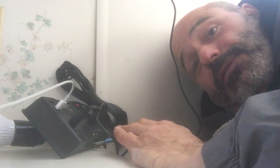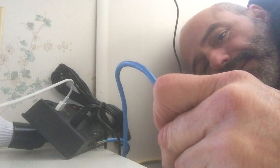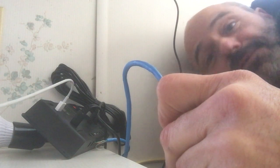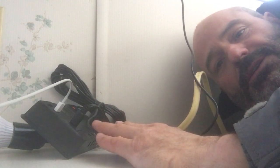This is the homesteader down at the Peace Eden homestead. What you see here is the charge controller for the solar panel array up here at the RV. I had pre-wired the first thing I had, some 10 base T — four twisted pair with 24 AWG wire gauge. First I did it with that, and then I was afraid it wasn't getting good readings and carrying good power from the battery up here, so I'm going to do it with Romex over to my two 12-volt batteries down here under the RV and up here to the charge controller.